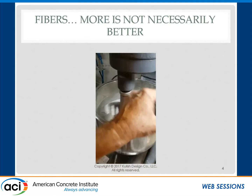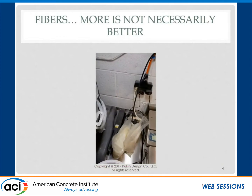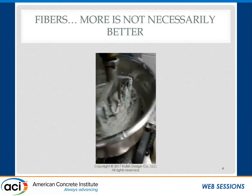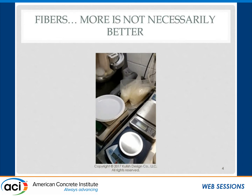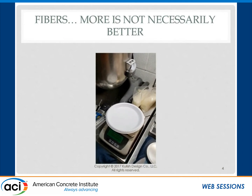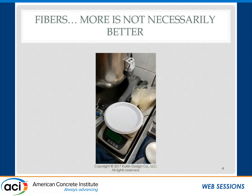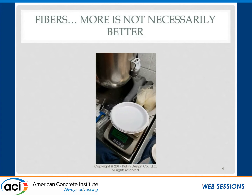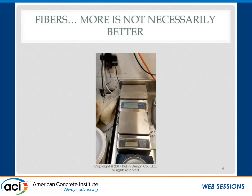In our world there are very little aggregates. My biggest particle in a mix is 280 microns on average, retained by the sieve, and not very much goes above that. So I thought: let's get so much fiber in there that the matrix is nothing but a steel wool ball with a little bit of glue. And as we all know, you can't have two physical entities occupying the same space at the same time. So the balance became: let's get the glue where we need it to hold together the binder — and in our world, the binder is the fiber.